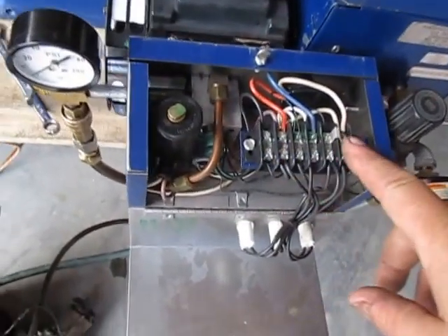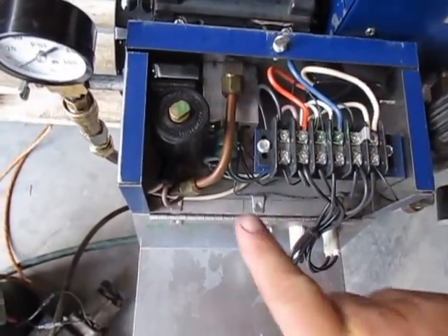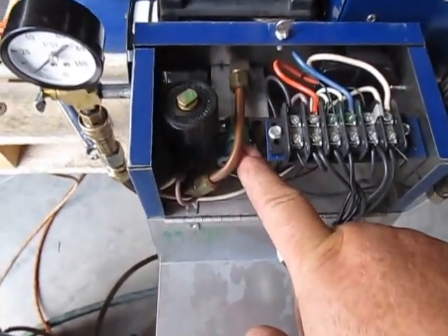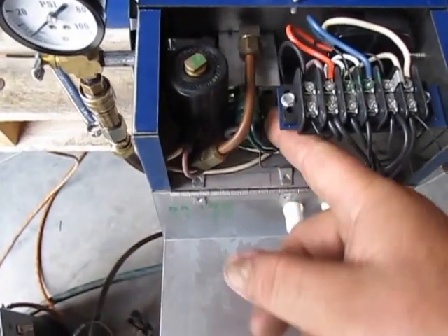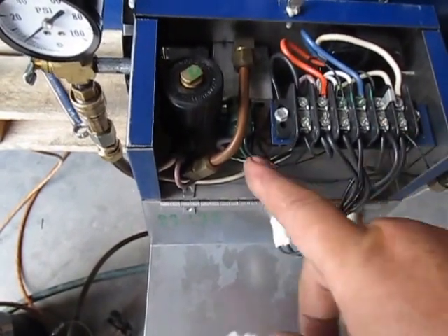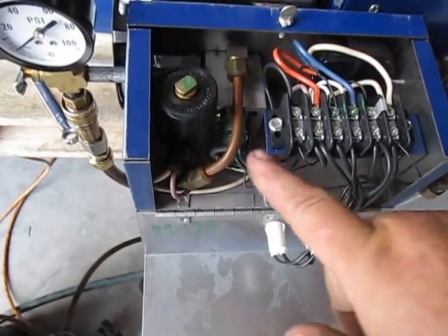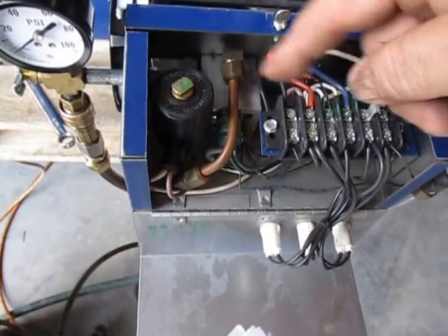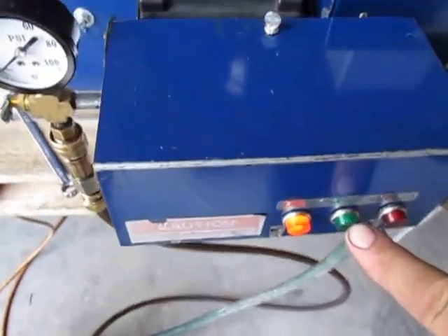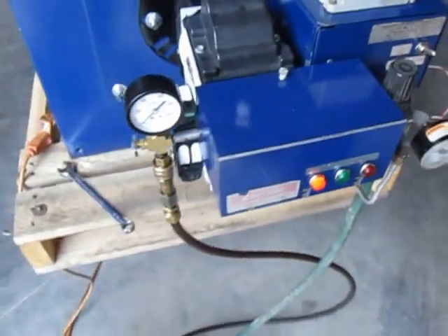Here is your terminal strip, your lower heater thermostat at 140 degrees, and the upper heater thermostat at 160 degrees. The lower heater is hooked to the one that goes back in the block; the upper heater is hooked to the big one with the 7/16 hex. The lower heater runs on the idle circuit (blue), the upper heater runs on the run circuit (orange), which also runs the oil solenoid. When that comes on you have a green indicator light showing the burner is on the run circuit.